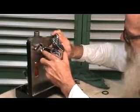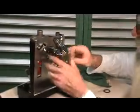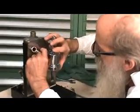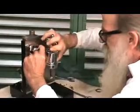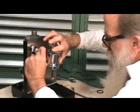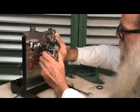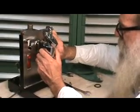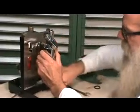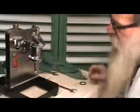That back plate needs to be kept loose because you have the two bottom assembly. You see, everything feels like it's flying apart, but it's not. And you get these started. Those are the group bolts you're putting in? Right, these are the group bolts, and you just get them started because if you hook that panel down with the bottom corners, you can get it out of alignment and you can actually tweak the panel a little bit.